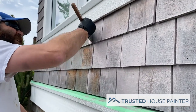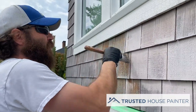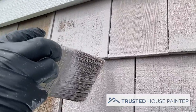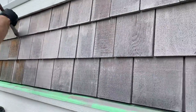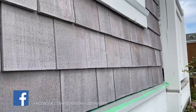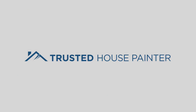Remember to catch your drips — there are lots of drips with stain. With all these angles you can see how the stain runs down in between and catches, so you always have to keep an eye backwards on what you've already done to make sure you get those drips before they solidify. Alright, thanks Clay, keep up the good work!